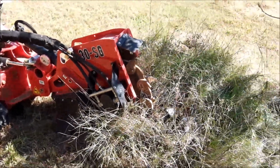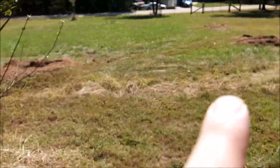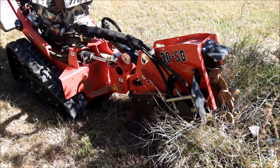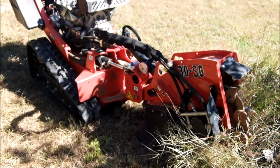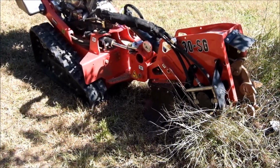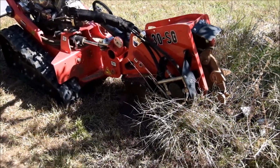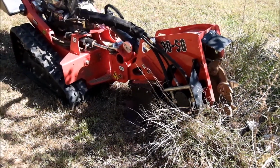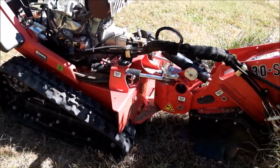Now I have done, like I said, a dozen stumps already, all over little piles. And you can easily do that within 4 hours if it had good teeth. And this rental's $200 for 4 hours, $300 for a day. I'm already on the day rental, even though I'm just about at 4. I'm gonna do a little more things here and there, but gosh, it's killer because of these teeth. It's not going as fast. Good piece of equipment though. Just bad tooth design.